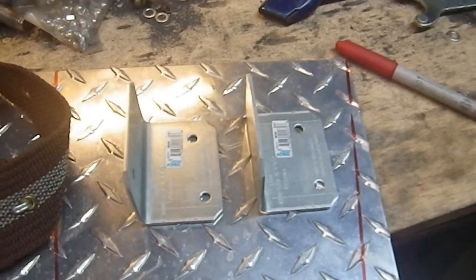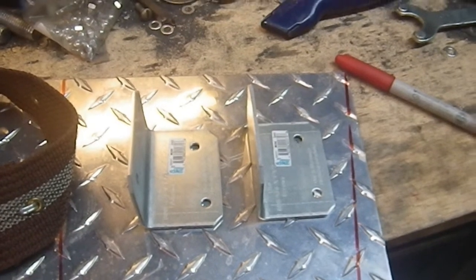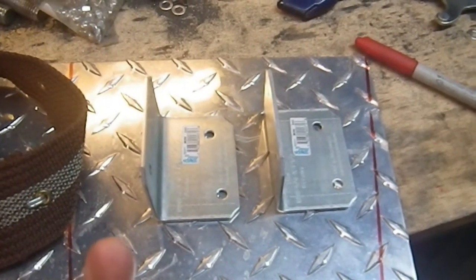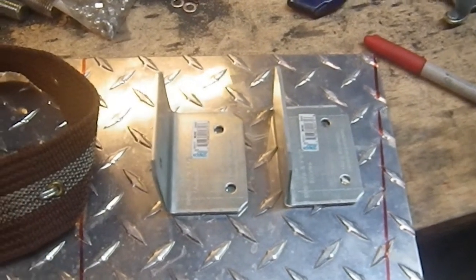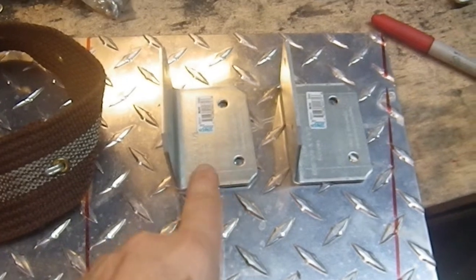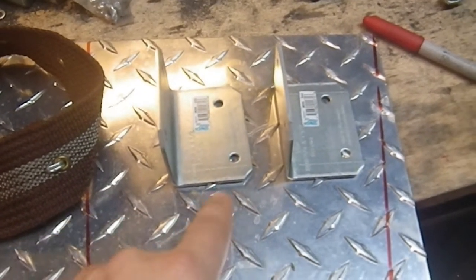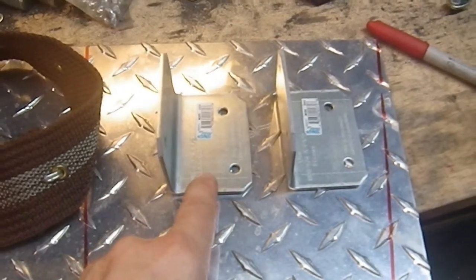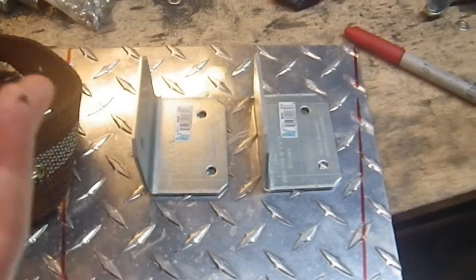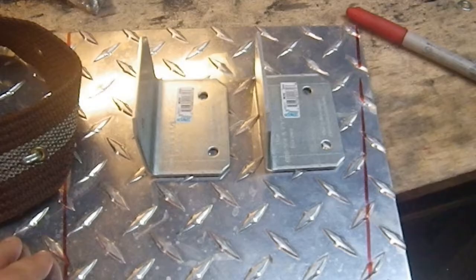So I would rather have that be the interior than have the pop rivet come from the inside out, because that would be ugly with the bottom of the pop rivet on the outside. If I can't get a nice clean flush, I'll just put the top head of a slotted screw on the outside. Will look better. And on the inside, you'll just have nuts, which you won't really see because they're going to be on the inside.